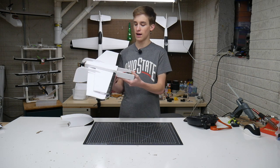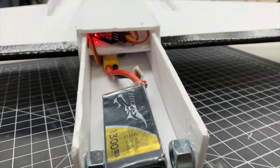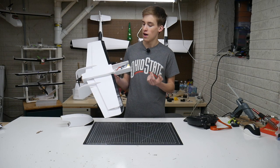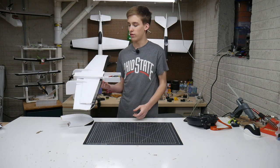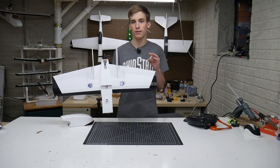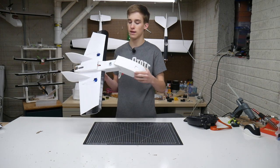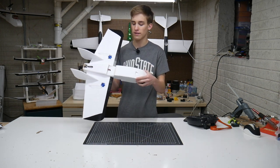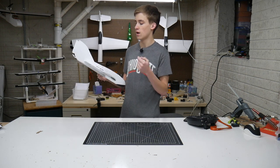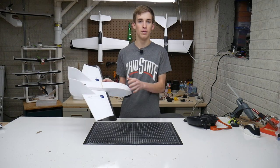I had to go ahead and glue in my XT60 connector, and you can see my ZTW ESC has a very short stem so I had to make a little modification there. I mounted my receiver right on the wing with the 90-degree antennas in comparison to the satellite. Pretty standard stuff — nose weight, receiver, ESC and antenna placement. The nose slides on pretty well and I added a barbecue skewer to do some spacing and make it look a little cleaner.